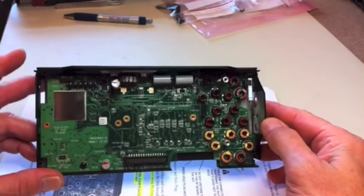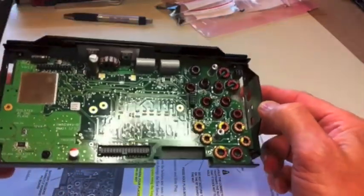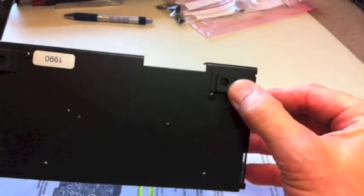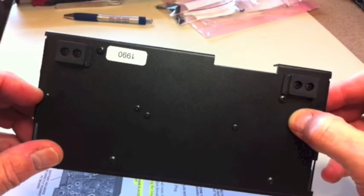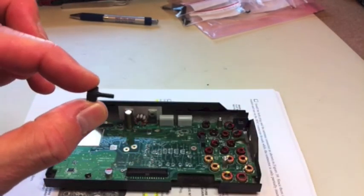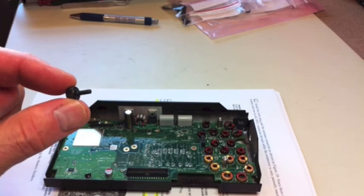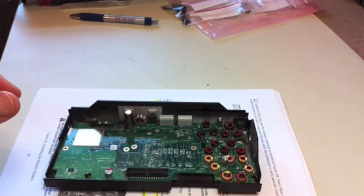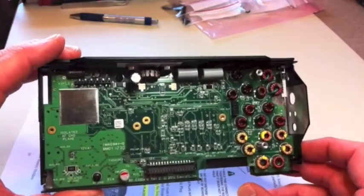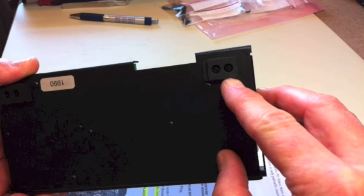Last night I was working on the bottom cover. I put in the RF board, but before that, on the back of the board, you have some rubber feet to put on. The feet are held in with nylon bolts, and they ask you to take this thumb screw — which is a 4-40 thread, the same as a nylon bolt — and run it through the holes on the cover before you put the nylon bolts through. It's a very good idea because when I ran the nylon bolts in, it was very smooth going in.